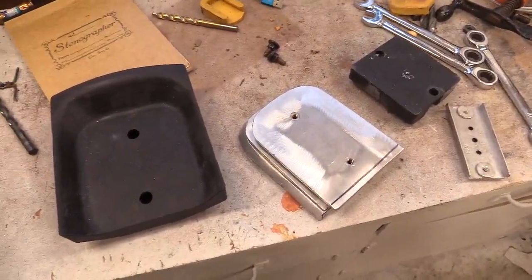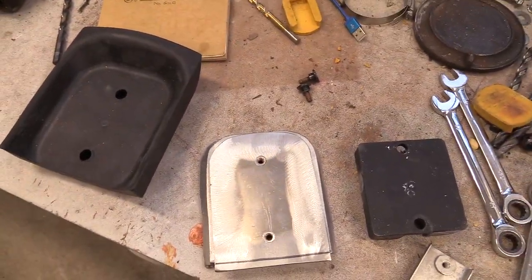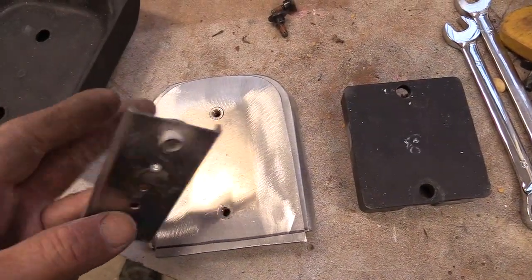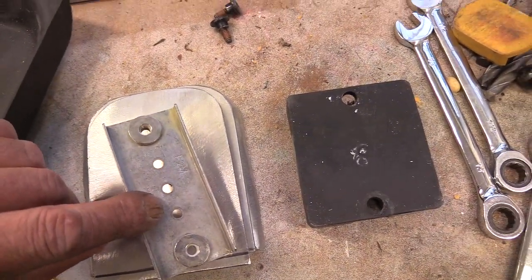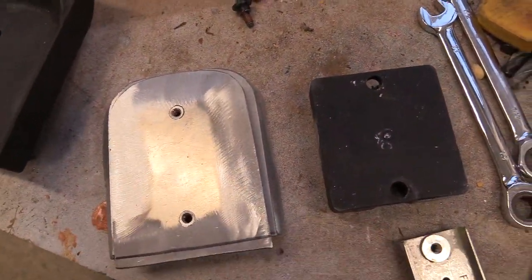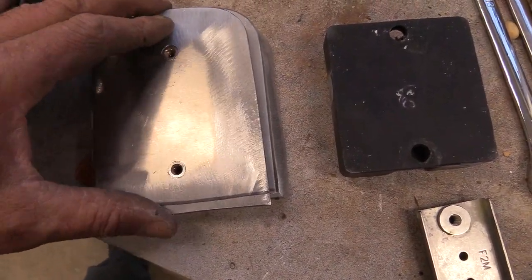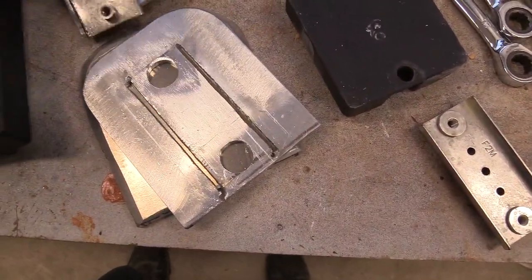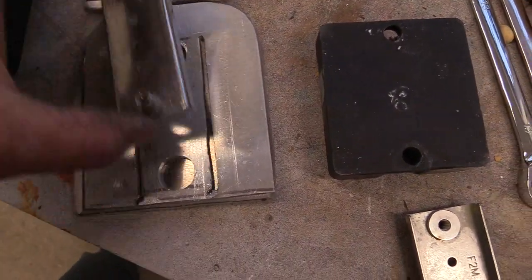This is what I came up with for the front engine mount. I pulled these out of the jet ski, which is what they were originally bolted into — this is inside the fiberglass plastic. I decided to do this in layers to get the height that I need in the bottom of the boat, and I went ahead and cut out the center section to hold this piece.